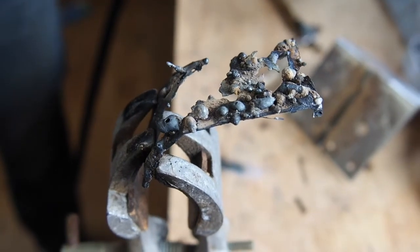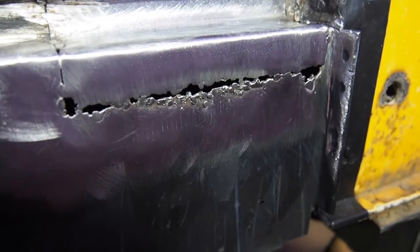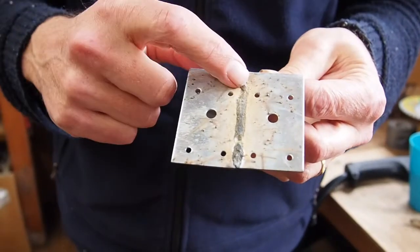So it's a problem, but through this experiment I've determined that I'm going to have to use output 1 — albeit with a lower quality weld — on the back of the Combi when I'm finishing this welding off, because otherwise it's not going to work. When I tried output 2, the higher output, on this thicker practice piece, it came out perfectly.